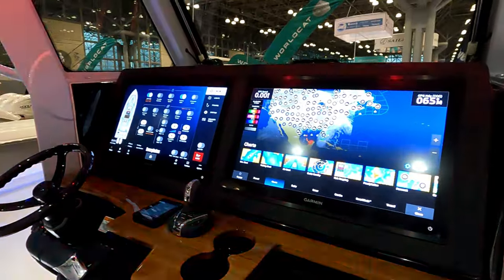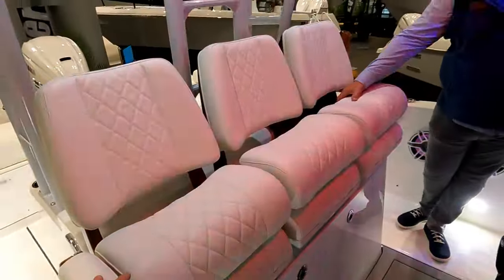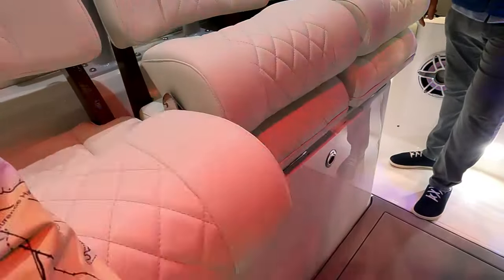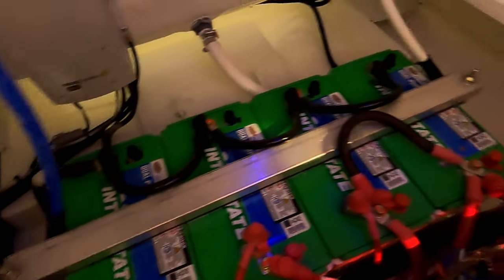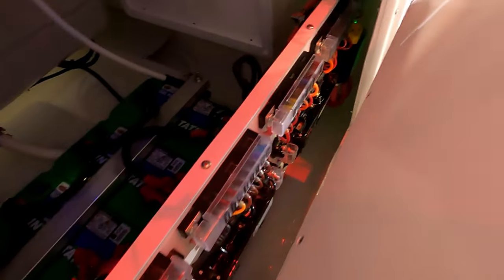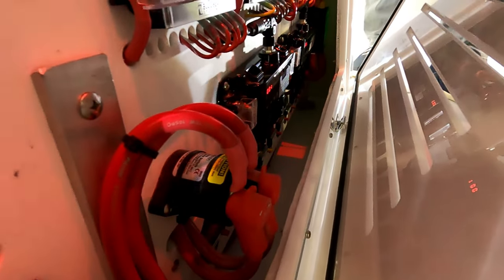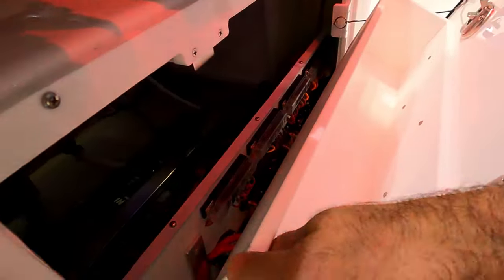All the Release teak is beautiful — at the helm seating too, with three-wide seating and bolsters, very comfortable. The battery access panel shows everything clearly: all the wiring and harnesses are made at Everglades custom to each specific boat, not stretched to fit multiple models. Easy access to everything, all labeled. There are remote switches for the battery so you don't have to come down here every time. All machine-swaged, tin-copper wiring. Very thoughtful use of space with extra storage here too.